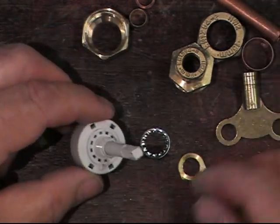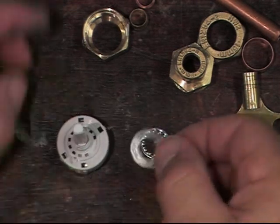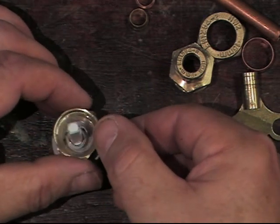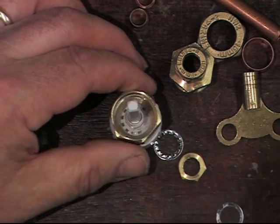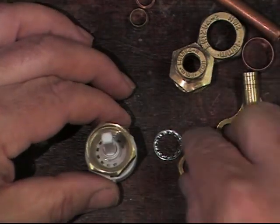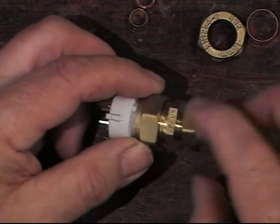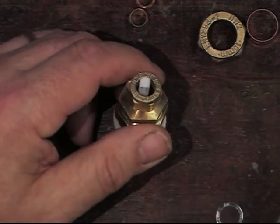The only bit I've had to make up for this is a washer in effect out of thin acrylic. This sits inside the bottom fitting and then that goes over the switch fitting. We've got a jig, brilliant. Right, we can put the nut on, put this back over, and that's still free to tighten down to clamp into the surface of the cabinet, the wooden surface.